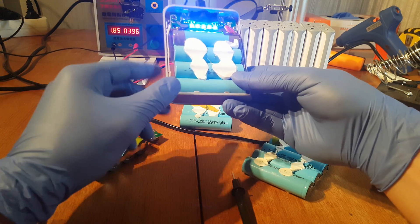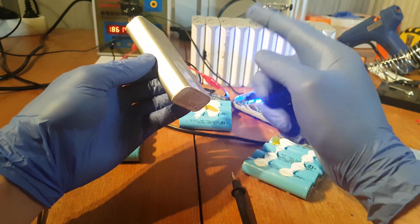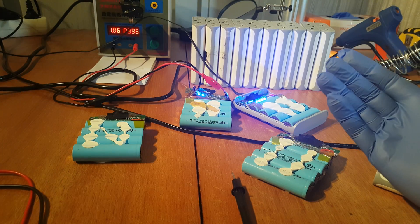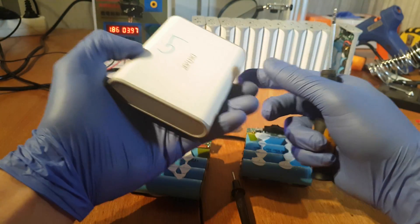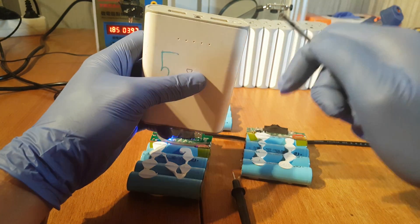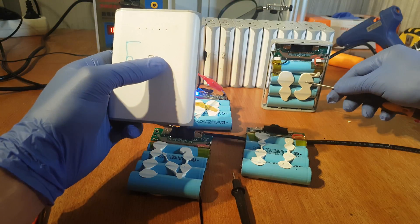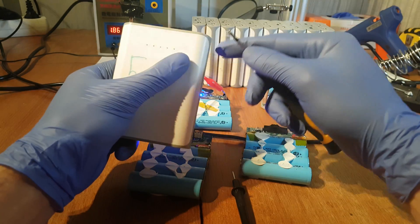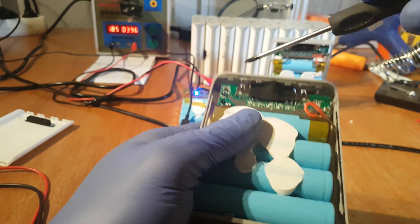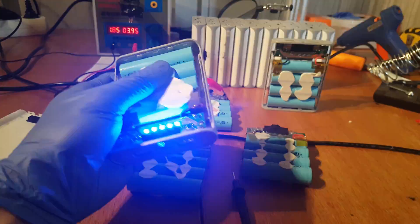That's a way to check them without any cell tester. You might also go ahead and buy new power banks, which will contain guaranteed good cells tested from the factory. But if you're going to use old power banks like me, to open them just go ahead with a very tiny screwdriver and start from the side where the charger port is — because on that side there's the board which you can damage. You care about protecting the cells and not short-circuiting them. Just pop it off, then unscrew the bolts holding the charging port.